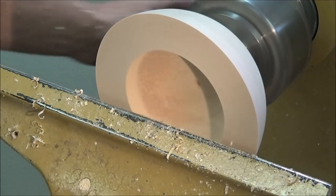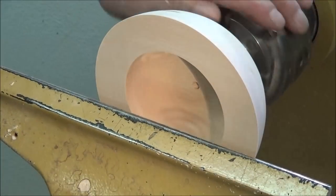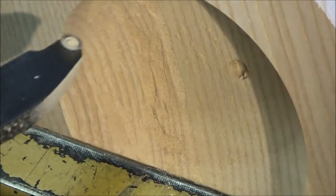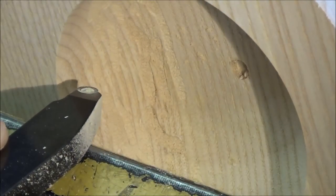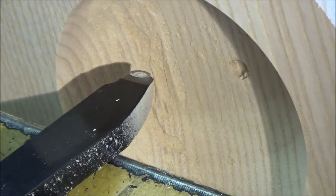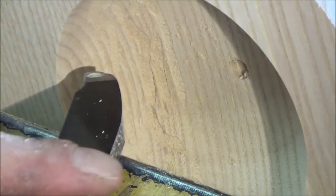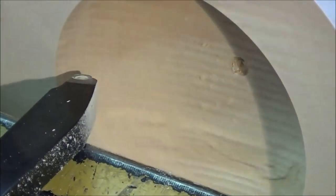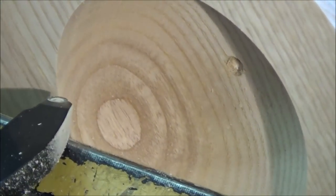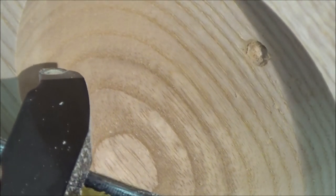For beginners who haven't quite mastered how to use the gouges and stuff, these are perfectly safe. That's the number one cutter; the number two will take a slightly bigger cut and give you a slightly better finish because it's a bigger radius. Look — end grain nice and clean, long grain clean too. Ash is usually quite a coarse, open-grain timber, so that's impressive.